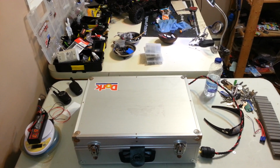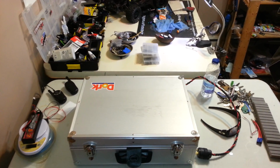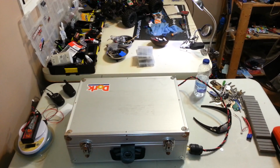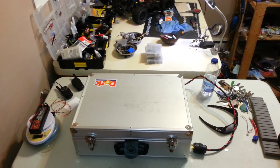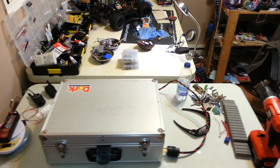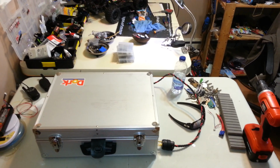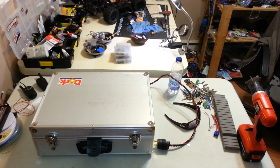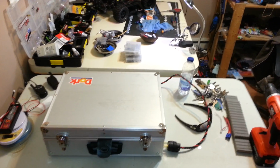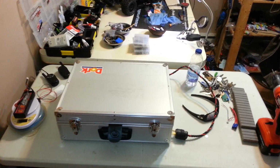I'll put the parts in the description, which includes a 360 watt 24 volt power supply. This power supply you can actually adjust plus or minus about 10-15%. I got it down to 19.5 volts, which is good enough for me. The charger I'm running will put out 20 amps, but it's a buck boost charger, so it only draws about 9 amps and turns it into 20, which is nice.